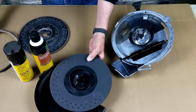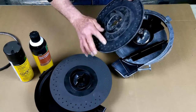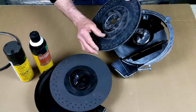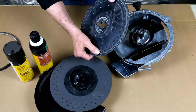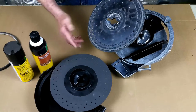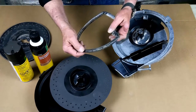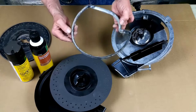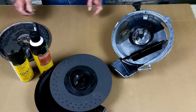I have a disc right here that shows quite a bit of wear on the back side where it runs against the seal. This needs to be replaced just because of this worn area — it won't let the seal actually sit flat against the disc. The other side of the disc is not in that bad of shape and the tabs that place the seeds would probably be okay, but it probably needs to be replaced. This seal example is really worn out — as you can see the lip is completely gone. This definitely needs to be replaced or you're going to lose a lot of vacuum in this particular meter.